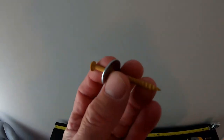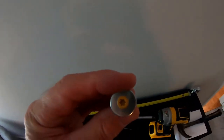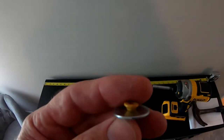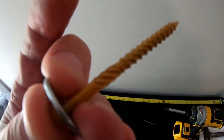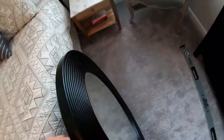You have to have a sturdy enough screw — this is a deck screw, which is what you want: a heavy-duty screw. I'm using an impact driver to put it in. For safety, I like to take one of these fender washers and put it on the end. When I go to hang this object, I'll make sure that wire is behind that flat washer.